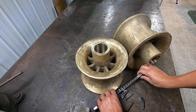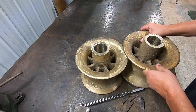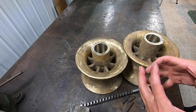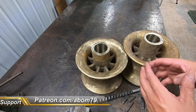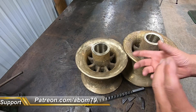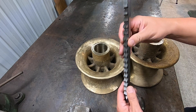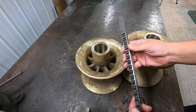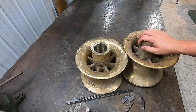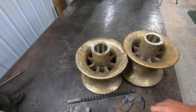This would be an excellent job for the Davis key seater, but the only problem is I don't have any of the tooling needed to hold the cutter inside there. I've got to make a base plate and some plugs to properly hold the broach on center. So we're going to use the press to get this done. We'll find a piece of stock, cut it off, make a custom broach plug, then go to the mill and start milling our slot.